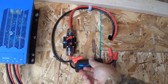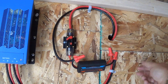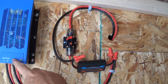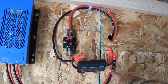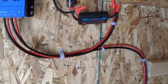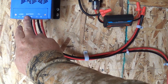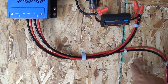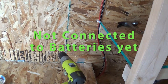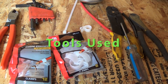I've got the red wire going in here, coming out, and going into this little meter. I'll put some velcro on the back so it'll stick and be easier to read. The black comes around — I've got twist ties holding things in order — and then these leads go into the charge controller at the PV input. I've got little cable clamps to help hold them in place. From the charge controller, two wires come off for the battery, follow the side, and go into the battery box.